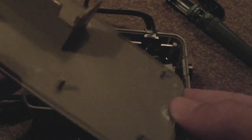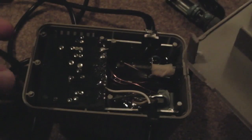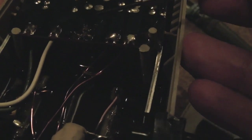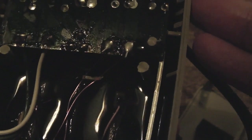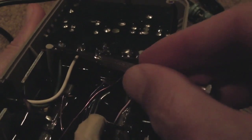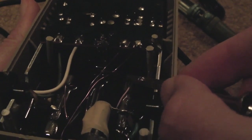I've prised the lid off here. It had been previously glued with superglue on a few points — just bits of epoxy. As you can see, the whole transformer is sunk into the potting compound — some epoxy they've filled it with. You can just about see the 7805 regulator down there. I suspect the issue is in there; it may be that a bridge is used to feed DC into that regulator and maybe half the bridge has gone. I can test the diodes. I'm going to desolder the three connections on the voltage regulator and see if I can lift this board out — it's just held by four wires.